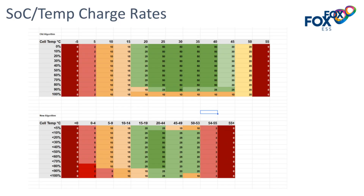When you look at the pattern, they've reduced the maximum charging amperage and brought it back — though it's not entirely fair to compare directly because the X and Y axes are slightly different on the new documentation. What you're looking at from 20 to 44°C is actually similar to the older algorithm, except you can see it de-rates earlier — above 80%, 90% to 100% state of charge, it's de-rating amps much sooner, even down to 5 amps on a battery that's under 10 degrees and above 90% state of charge. I've had to reverse engineer some of the charts I was given, but it should give a rough idea of what's going on.